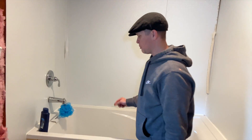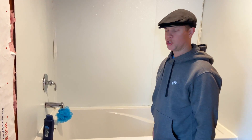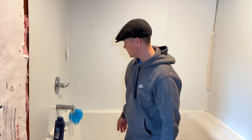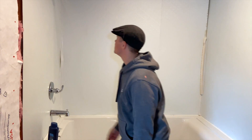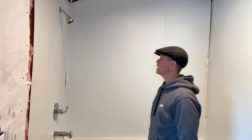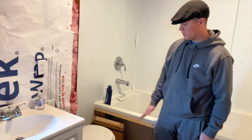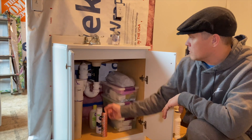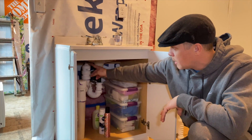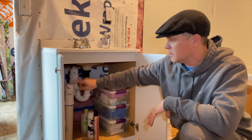Here's our deep-soak bathtub. We have three kids and we wanted them all to be able to fit in there — and the wife could fit in there as well, it's huge. You can tell we've got plenty of water pressure coming out of the bathtub and the shower is really nice too. For a shower it's super hot with great pressure, but when you're taking a bath you need to take your time and let it heat up. We have a composting toilet right here — I think it's the Airhead composting toilet. We have a straight valve instead of a tank — a valve that goes over gray water for our urine. Right here is our drain system for our bathroom vanity, with our P-trap and internal vent pipe right there. We didn't go through the roof like most residential homes — we don't have just one stack — and this goes out to gray water.